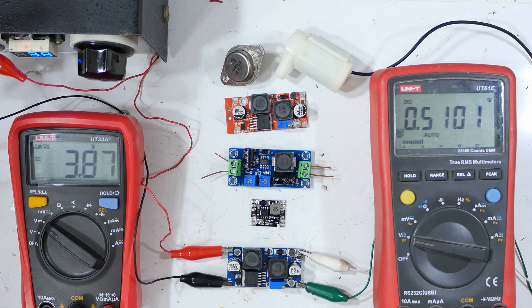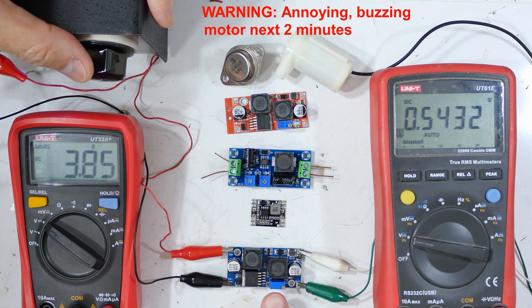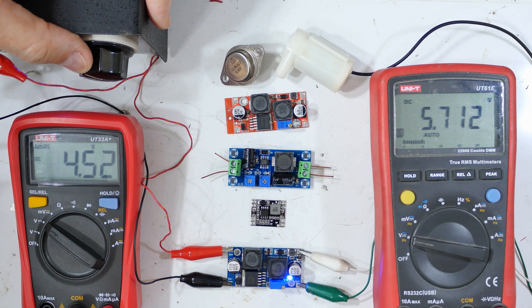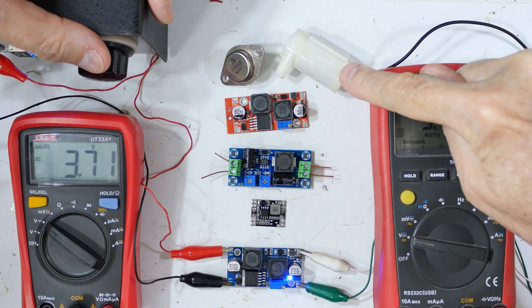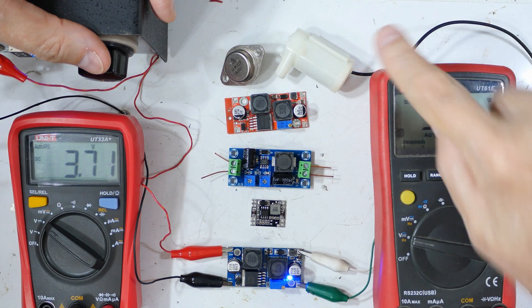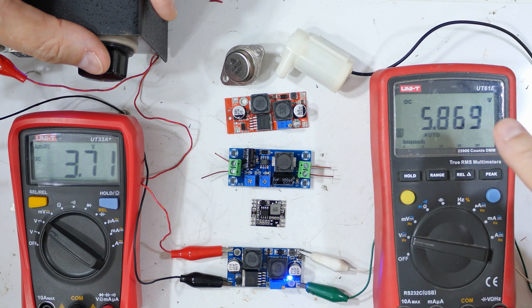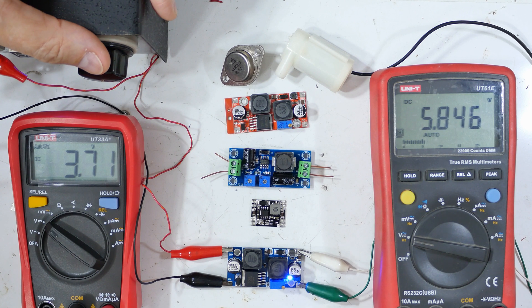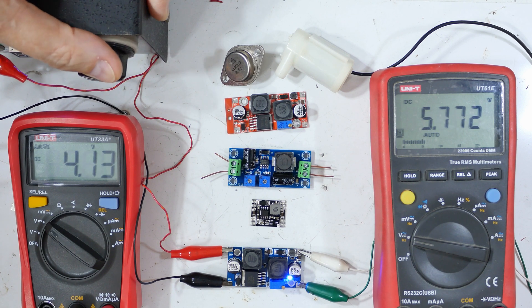Turn on the power supply — here is the input voltage and here's the output voltage. We've got this one connected, and as you can see, when I get up to about 3.8 volts it will stabilize at about 5.5 to 5.6 volts. I've got this motor on here — you're hearing it humming in the background. I need a load on this otherwise the output is not stable. If you just use the digital voltmeter to measure the output with no other load, it can vary — I've seen it jump up to like 30 volts, which is not good. So you can see the input is 3.7 and the output is 5.